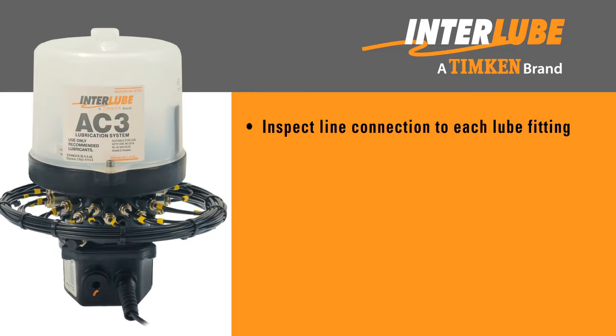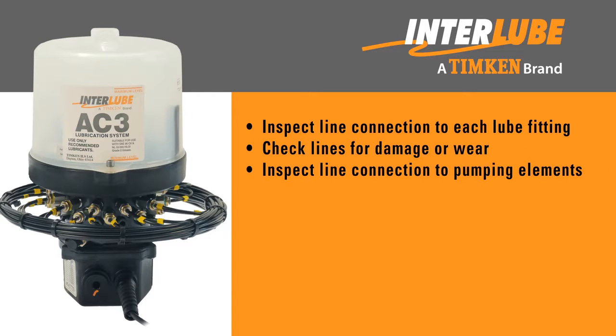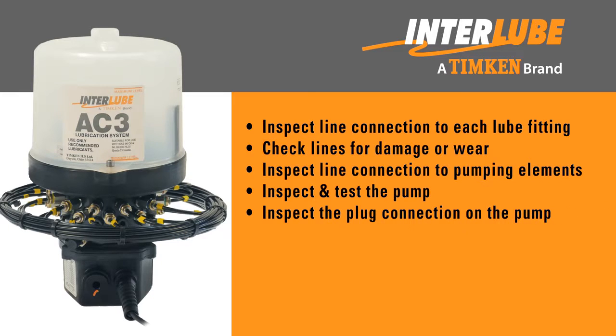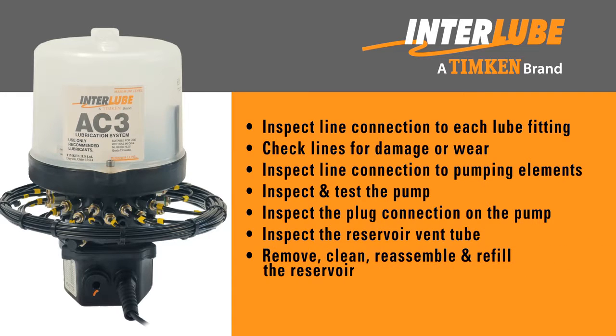to each lube fitting, check each line for any signs of damage or wear, inspect the line connection to each pumping element, inspect and test the pump, inspect the plug connection on the pump, inspect the reservoir vent tube, know how to properly remove, clean, reassemble and refill the reservoir, and replace the label if it is peeled or missing. Be sure to wear the required safety gear when performing this work.